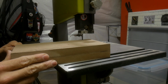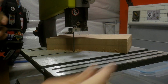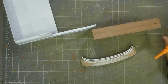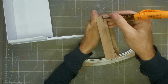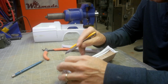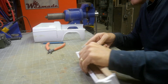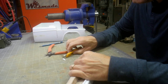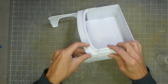The hood starts with a large block of MDF made by gluing up smaller pieces. This is rough cut on the bandsaw before getting fit to the front fenders. I then decided to make the windshield cowl so I could get a more accurate measurement for the hood. This was carved from MDF as well, and then vacuum formed from styrene. The piece gets cut to shape and solvent glued in place.